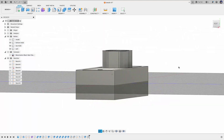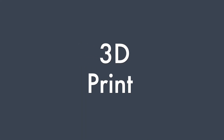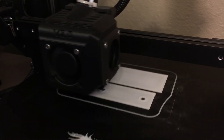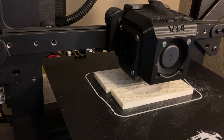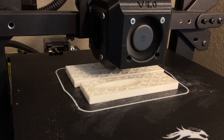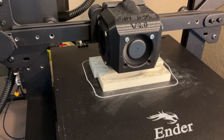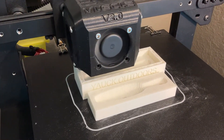I also added a couple of wells to capture the escaped plastisol. The whole thing looks like a traditional sand casting mold. The only difference is that traditionally we pour melted iron through the sprue holes, whereas here we are pouring plastisol into the bottom mold only and then pushing the top mold into the box. The key point is that with this mold, we don't need an injector to make the bait anymore.